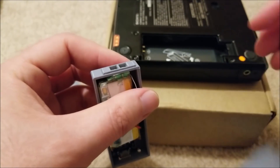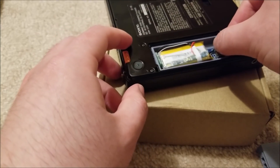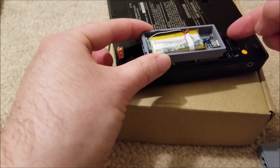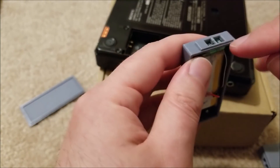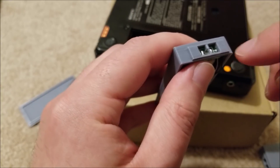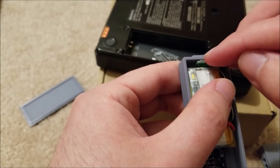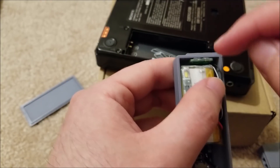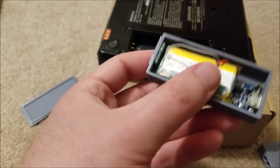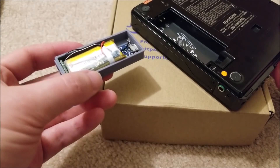On the other end I didn't really change anything, but I found that when I insert this into the bay, the second version is too loose — I over-compensated. So I need to increase the length just a tiny bit. Also, I cut out a surface-mount capacitor board and tried to wire it in, but it sits too far back. I'll need to push it forward, cut some plastic to make that section thinner so the board is closer to the pins.